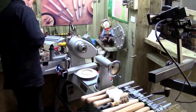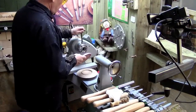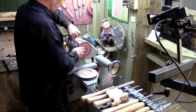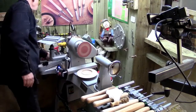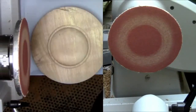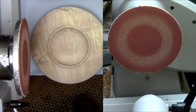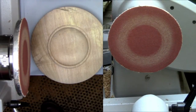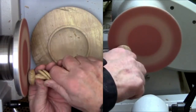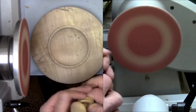I've got the Simon Hope sanding disc here, which has the 55mm recess, so it fits beautifully into the jaws of the chuck like that. And then all we'll do is sand up the top and bottom, not forgetting to put my air cap on to protect my lungs, and also to have my extractor going and my AS400. I've got the Camvac going, I've got the AS400, and I've also got my air cap on as well.